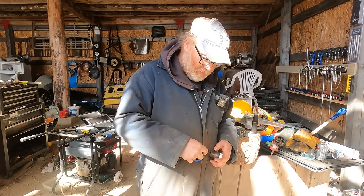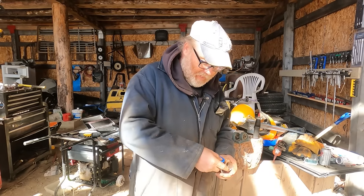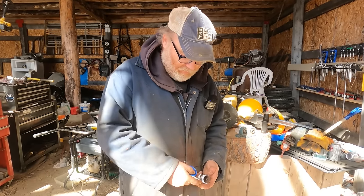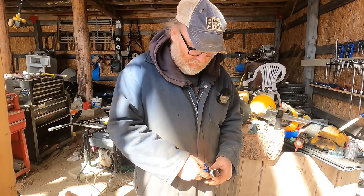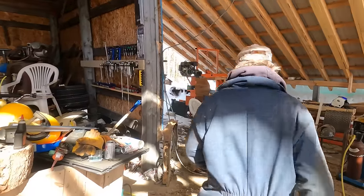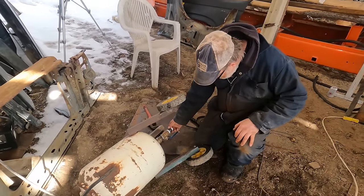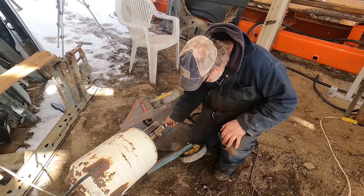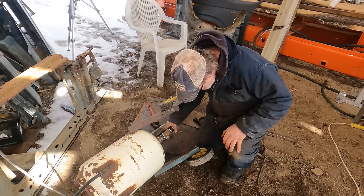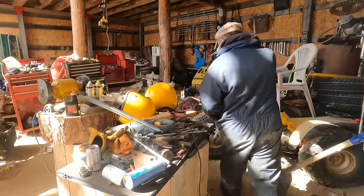Like I say, all this has to do is keep the sand from coming out of here and a little bit of air from escaping. Mostly the air. There's not a whole lot of air come down through here until it's almost out of sand. Now this here, it gets threaded onto here now. Just like this. Gets threaded into this section. There. I'll turn this way now. And then now, I need this pipe fitting here, this T.